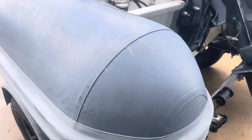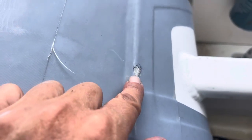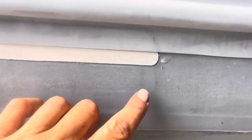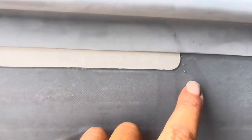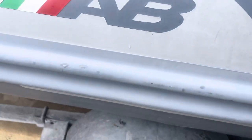Okay Tom, here's what we found on the AB — just about everything is minor. We have some delamination on our transom holder. We did have a leak; I made you a whole other video earlier before the rainstorms came. We had a leak right here at these two little pinhole spots, so we need to pull this strip, pull a portion of the rub rail, and get a patch in there.